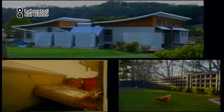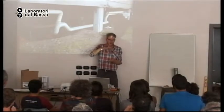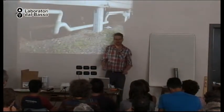And here, they did not put the tank level. It was tilted. And it was not a strong foundation. And it went into the neighbor's house. So you have to do it right. Here we have a bladder tank that can go under a floor of a house where you don't have much space. So when there's no water, it deflates, and then when there's water, it fills up. It's a bag. A water purse.